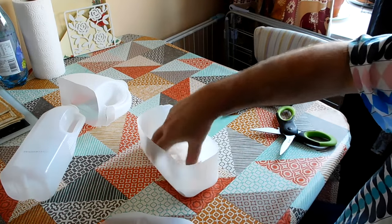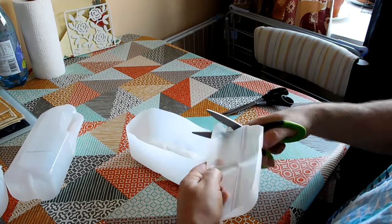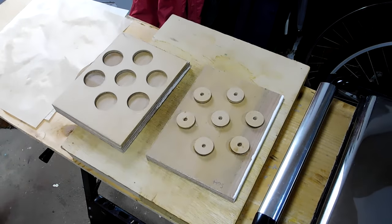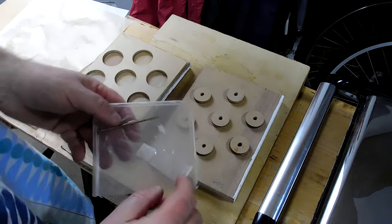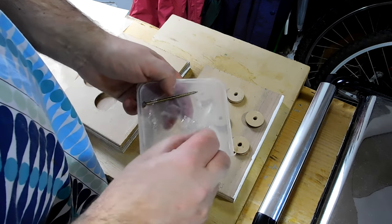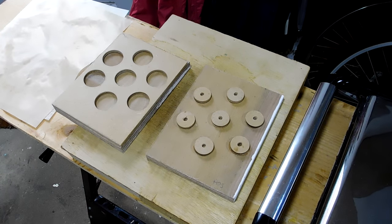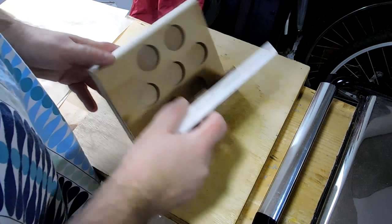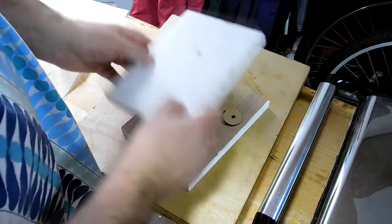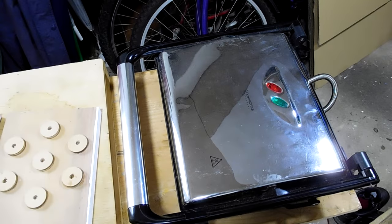About a quarter full now, let's keep going until it's maybe two thirds full — that's probably enough plastic for our experiment. My glue has dried and those are nice and firm now. A little tip for epoxy: if you want to know when the glue in the joint is dry, just don't throw away your mixing thing. Then you can tell when this has gone hard and set, and you'll know that the glue in the joint has set as well, as long as it's at the same temperature. What we've got is two halves of a mould and I can tell by the wiggle room there that those are still nicely registered. Let's get started with the old sandwich toaster and start melting our plastic.